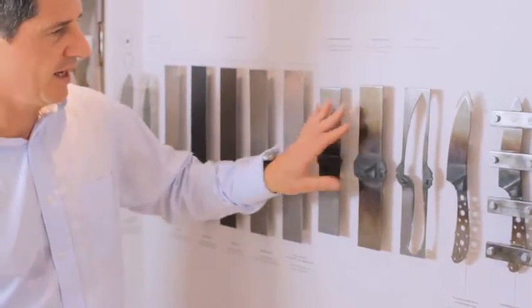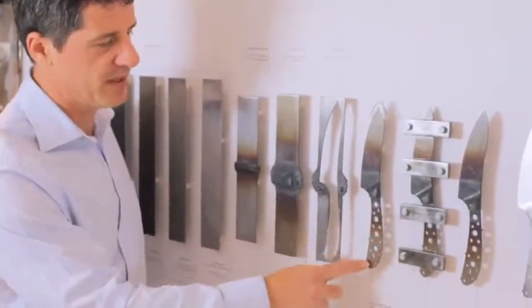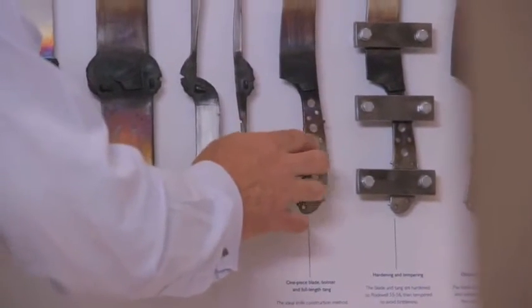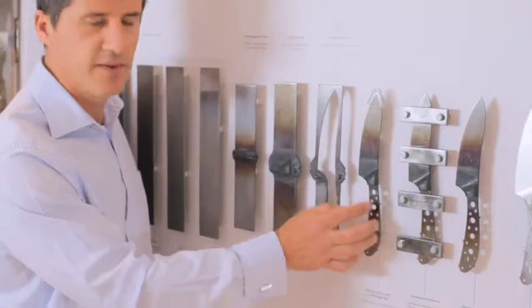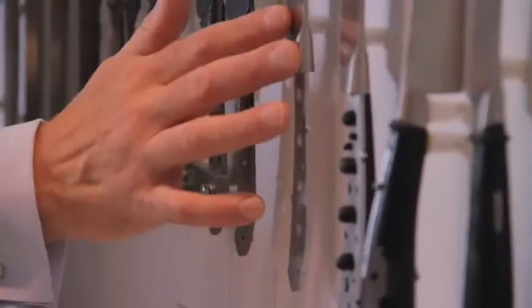And from this piece here, they then clip out the very basic shape of the knife. And at this early stage, I point out here the holes in the handle, and this forms a very important part of it, because this is where the injection molding on the plastic, these will be filled to bond the handle to the tang here. We get to a point where the tang is cleaned off and dressed off beautifully. You can see the changes in the colour of the metal.